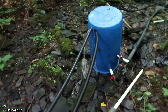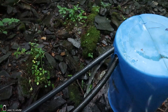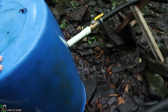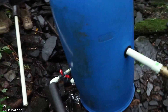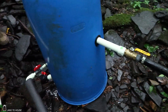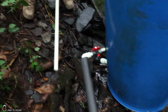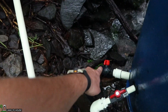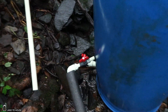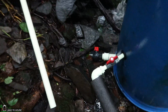The turbine currently has a 3/16th nozzle open, and this is the overflow that we've got coming out of the barrel. This barrel acts as a reservoir to hold water that's air-free for the source of the turbine. We've also got silt catchment in the bottom, so we can open up this valve down here to drain out the silt and sediment. They've also got drinking water that comes out of this tube here, going to their house.